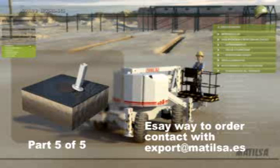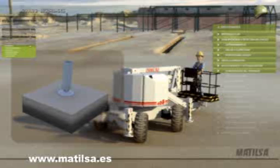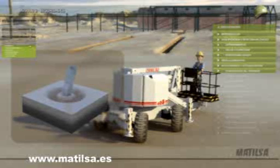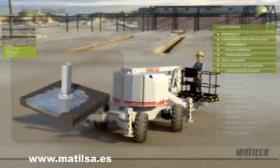may cause a lack of stabilization. Adverse weather conditions, such as rain, may cause the ground to be completely unstable. In this case, we should not work, even with the use of the stabilizers, since according to the type of the ground, this will allow the stabilizers to sink into the ground, thus causing a lack of stabilization. Frozen ground may look firm, but may break or defrost on the supporting points.